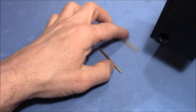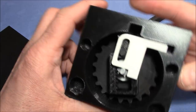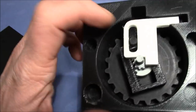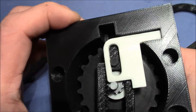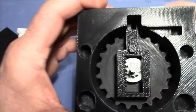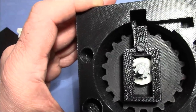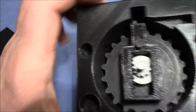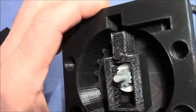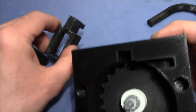Here you can see the hole with a locking bar that is controlled by this whole wheel pack. We have to first get rid of the pins here so we can remove the back plate. That's how it looks inside: the code is set correctly, the actuator is turned all the way down, and we can turn the whole thing. Let's remove the deadbolt so we can see the actuator — this black piece here. I turn it to the middle position, then turn the knob, and we can see it moving up and down. That's how you control the movement of the actuator with a bar. Taking this piece out, here we can see the bar and the inner wheels.